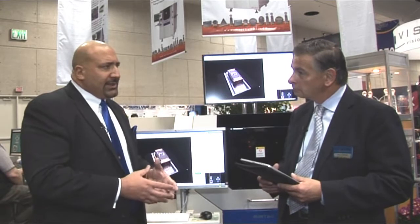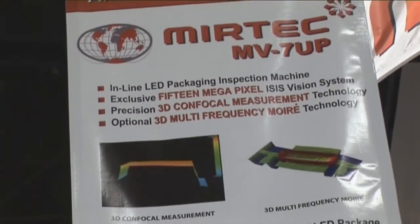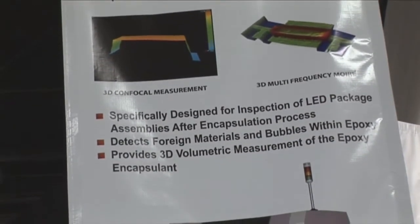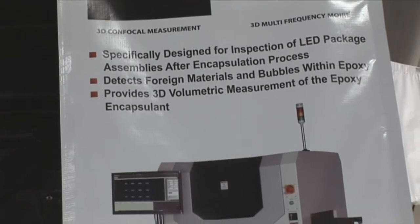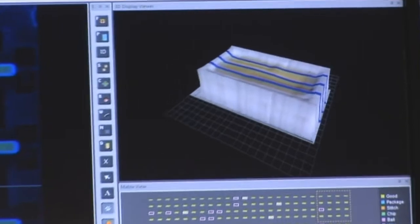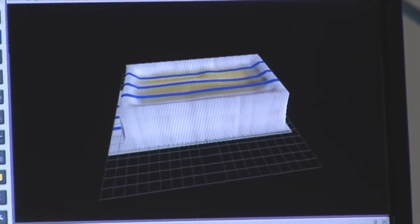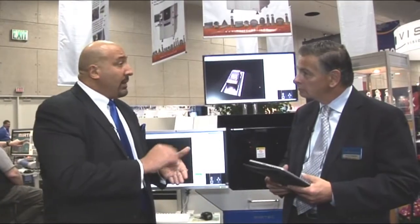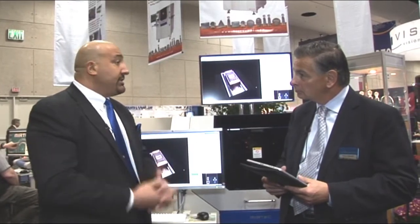What's really cool with confocal measurement is it's a little different — you can actually measure the height of water and measure a mirror, so reflectivity is not an issue. It's a little more costly but gives you the best results. The way it works is three confocal probes scan across each LED and come up with the topography of the encapsulant. We're looking to see if the encapsulation process is deficient or has an overfill of epoxy, and we set a low test and a high test — minimum and maximum quantities — to ensure we're within the acceptable criteria for the epoxy level.